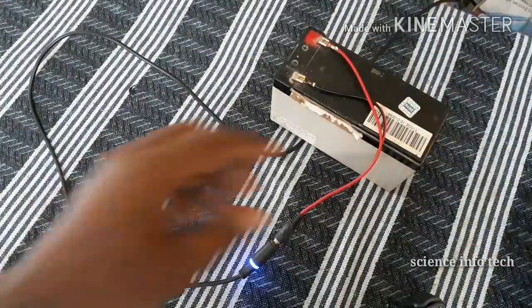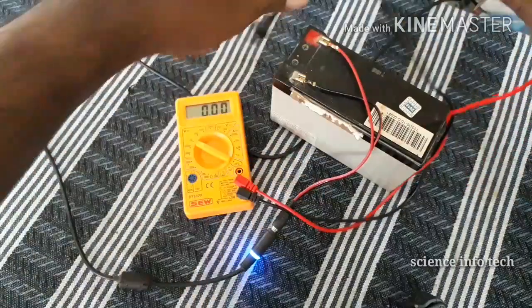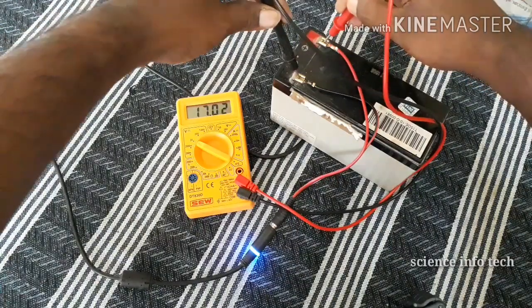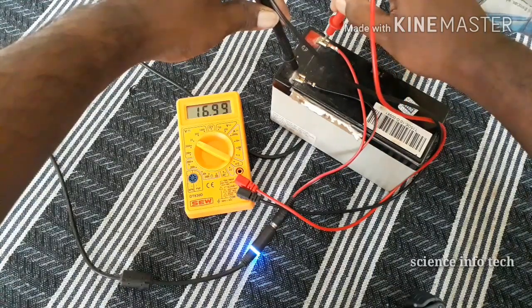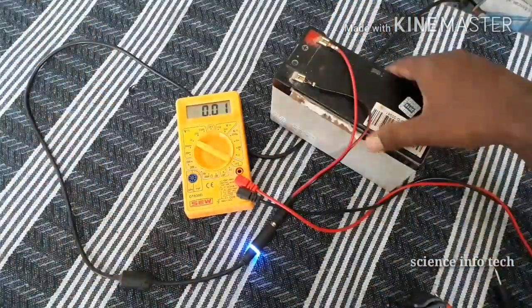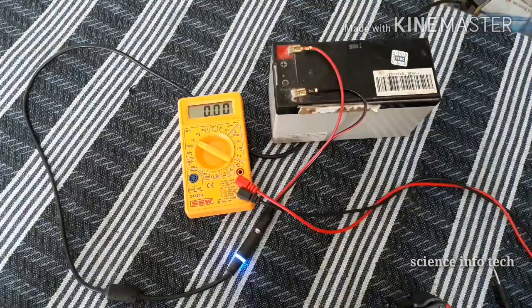But in the emergency time, you can charge the battery using a laptop charger. The battery voltage is 12V but the output is around 10V. The laptop charger voltage is greater than 15V, so when the battery voltage is less than 15V, you can use the laptop charger to charge it.